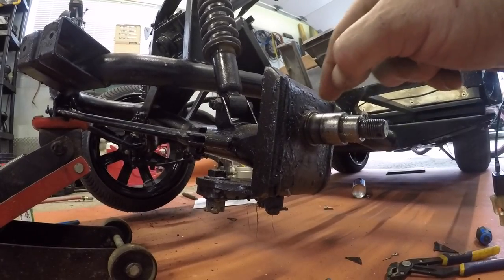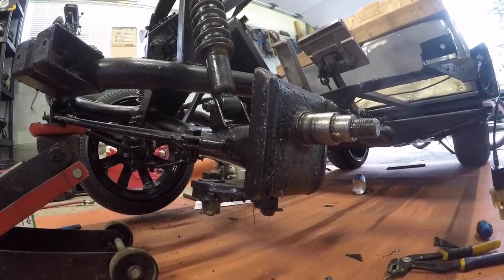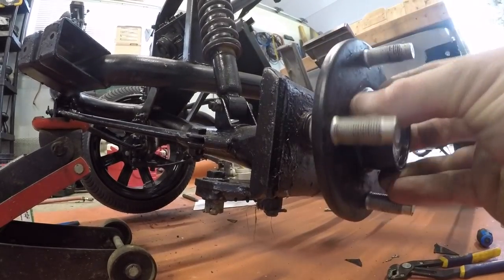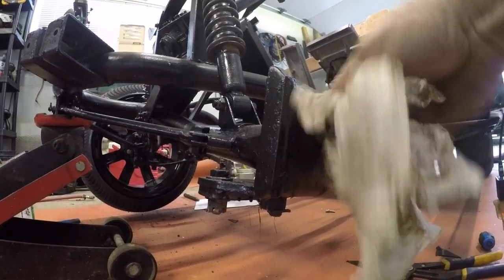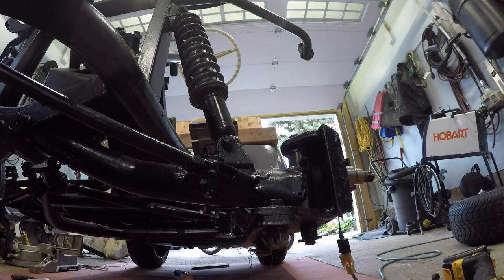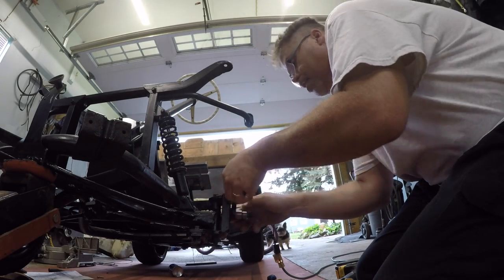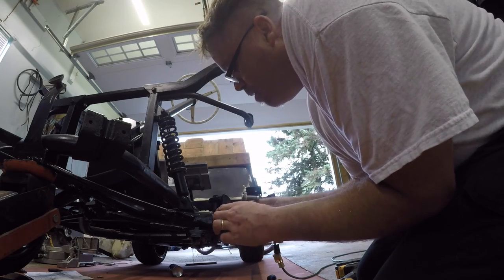So I'm trying to think. Normally I'd put a little bit of weld on this and just grind her back down, but it's so hard to get a perfect fit. The only other thing I can think of is throwing a couple washers on, but then the other bearing wouldn't go on - right there it's tight, but go back and it's got a little play. I'm going to try something really stupid just for the hell of it - one wrap of tape, and hopefully I can get the bearing to slide over it.